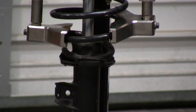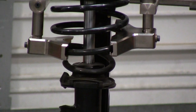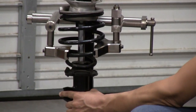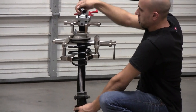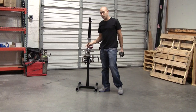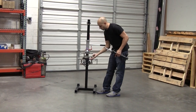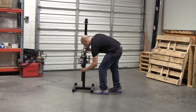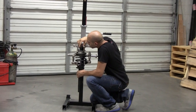Once this is freed up, you can go ahead and loosen your nut here. Now, because this has seated itself to this bearing plate, the other thing I want you to know is that when you go to put this back in, everything stays in the same position. So there's no need to get your fingers inside here or move anything around. The new one will just slide right back into place. Once you have it where you need it, you go ahead and tighten your nut.